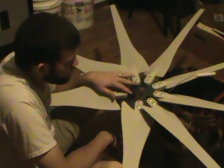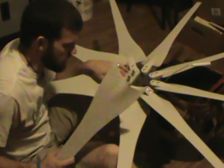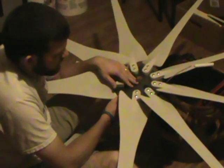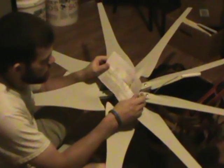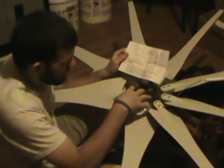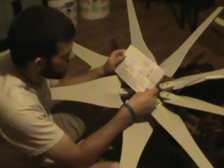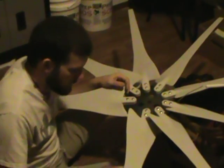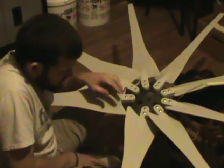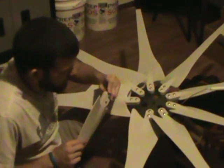Now we're at the portion of the build where we're mounting our blades to the plate. I've got one here to demonstrate how to mount and bolt that up. According to the very detailed instructions, it's recommended that this plate be painted because it can rust. So make sure to paint that part on the turbine. Also, these blades — they only recommend mounting them down to five foot pounds of pressure.